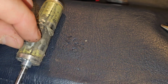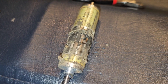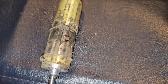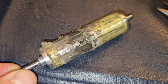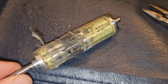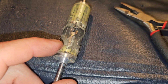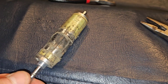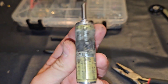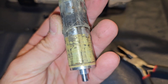I had noticed a few runs prior to this that the motor was running weaker - it didn't have the same power, didn't have the same RPM - and I noticed on my data logs that the amp draw was a little bit higher, maybe 35 to 45 amps higher than before. It looks like the wrap let go and then the magnet came out of the rotor. It's a six-pole motor with six magnets. That's terrible - no bueno.